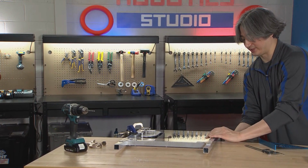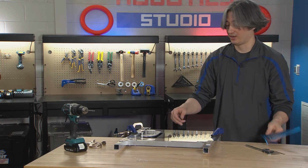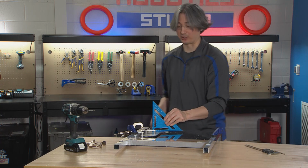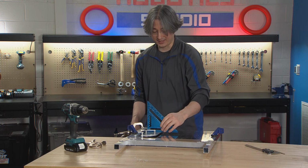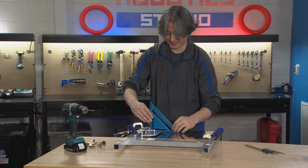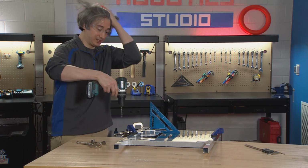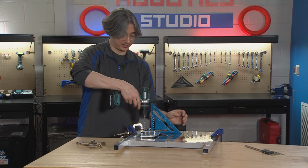So it's pretty close to flat, but you still have to make sure your reference is done to either the plastic, which is where I'd put this for my first hole, or any of the metal pieces, because those are what we're lined up with. So in this case, same thing. Maybe I can get it. Yeah, we'll go on the plastic again over here. And same process. I'm going to drill through the first step. Then we're going to reassess and make sure we're straight before we go the rest of the way through.